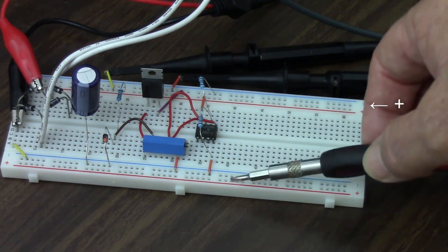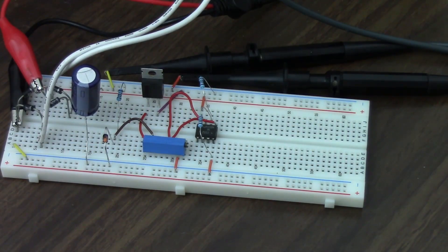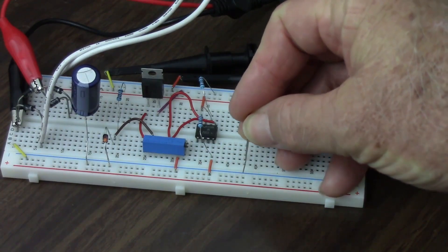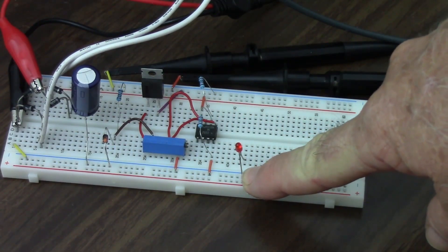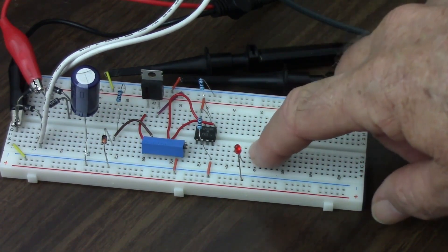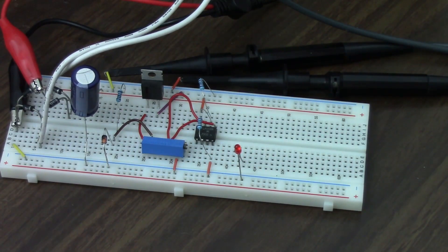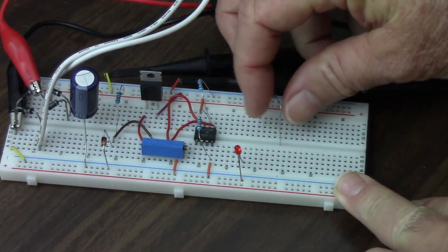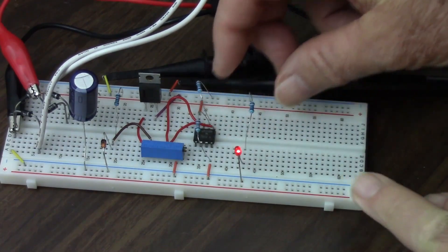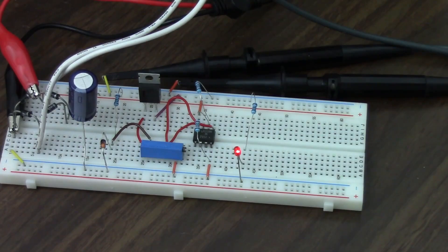This is like a battery where this is the positive terminal and this is the negative terminal, and I will use this to get the power to operate my little demonstration here. What I want to do to begin with is just show how I can use this 12 volts to light up a light emitting diode. I'm putting it with the cathode in the ground or the negative side and the anode up in these wires where I will be connecting other connections. Let's put a 1,000 ohm resistor from the positive 12 volts to the anode of this light emitting diode. Here is my regulated 12 volts — these five holes are connected together and you can see the light emitting diode lighting up when I hook up that 1,000 ohm resistor.